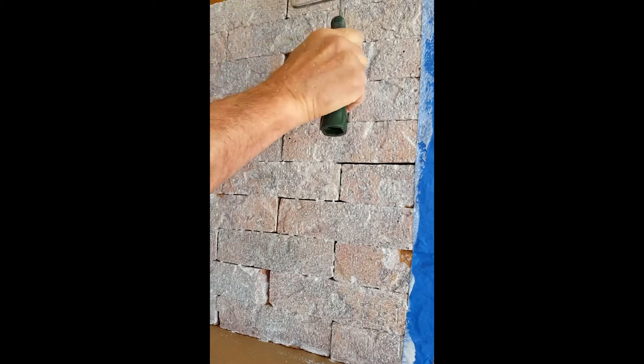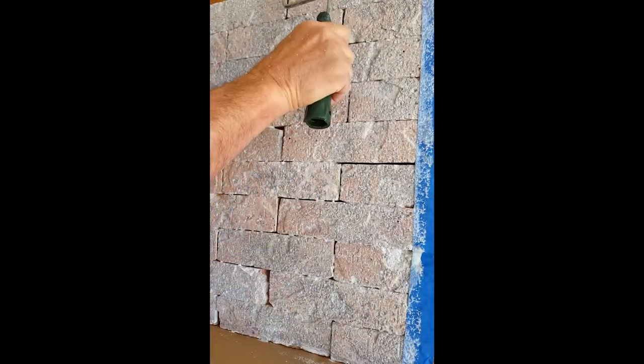At the end, after I get the material in, we will dress it off. We will roll it off in the same direction. Very gentle — just the pressure of the roller contacting the surface. What this will do is provide us with an even finish to work with our brush.